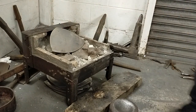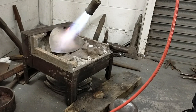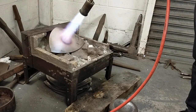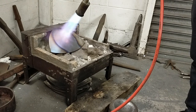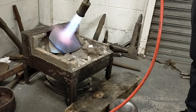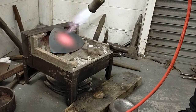Using a simple open forge like this, place one of the metal sheets down at a 45-degree angle so you can easily blast it with a propane torch. You can make these helmets without heat, but this makes it a lot quicker, plus you'll still need to weld the pieces together later. Torch the sheet for a few minutes until you have a nice red glow in the centre, making sure to keep the torch facing straight forwards towards the sheet at a 90-degree angle to ensure an even heat.